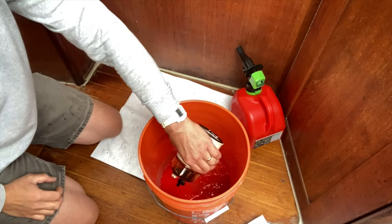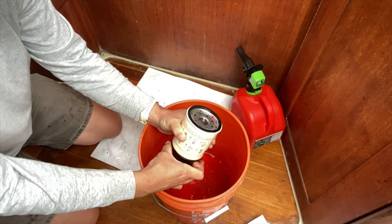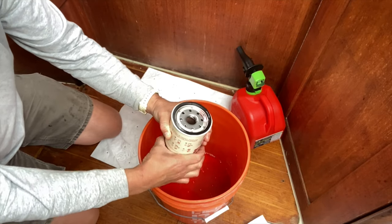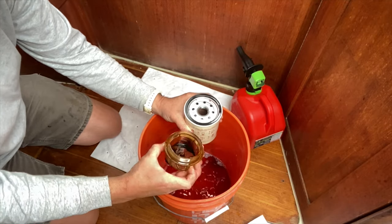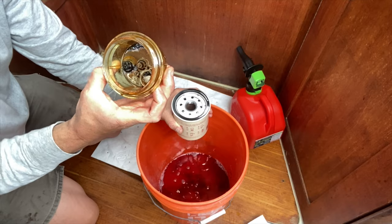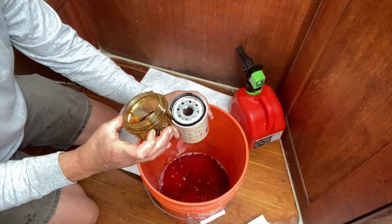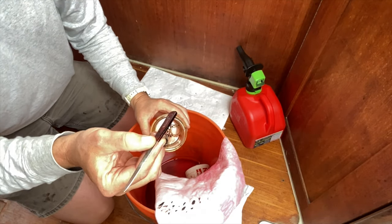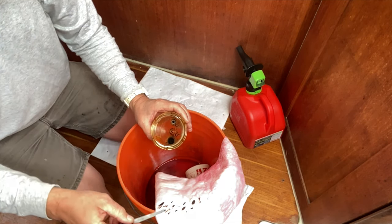The next step is to remove the water separator from the bottom of the old filter. I'm using a bucket to capture the diesel that was trapped in the old filter. Another alternative would have been to drain it out through one of the holes, but today we're going to recycle this diesel at an oil change facility where it can be disposed of properly. There's some residue in the bottom of the water capture vessel — that's worth noting and probably a good demonstration of why it's a good time to change this filter. I scraped the residue out using a Revlon emery board, which I've found to be a very valuable tool to keep in my boat toolbox.